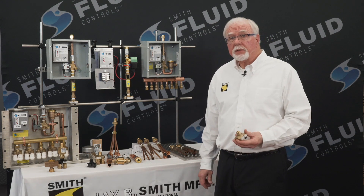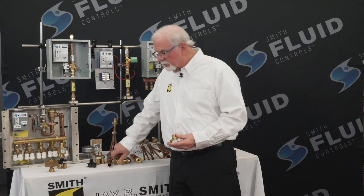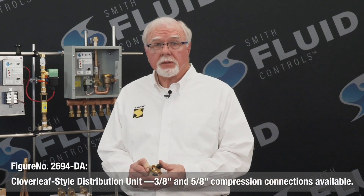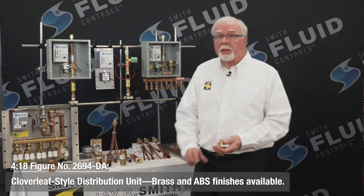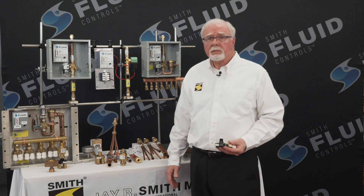Now, distribution devices. As mentioned earlier, this is a companion device for a singular solo unit or a singular trap priming valve. It will prime up to four floor drain P-traps when used with either one of these. This is also an engineered design, designed to allow equal distribution of water through the four ports. It is a patented design, furnished with four threaded port openings and can be provided with 3/8 and/or 5/8 compression connections. It is available in brass or ABS.